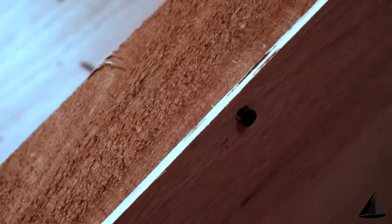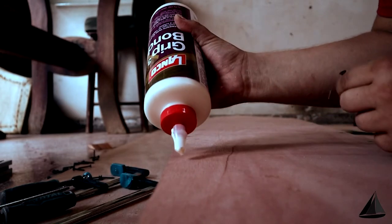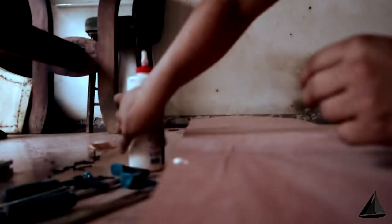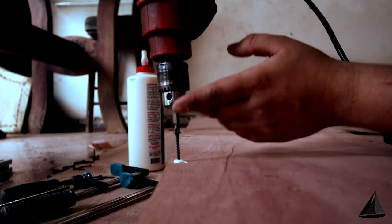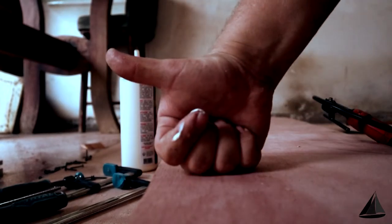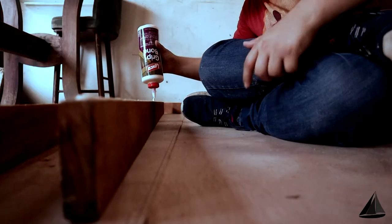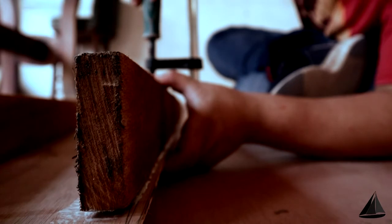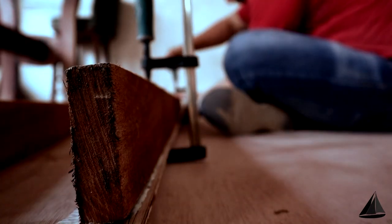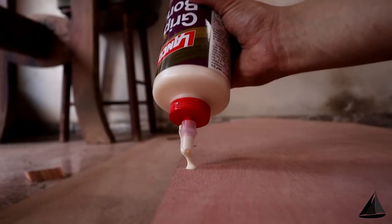To make it as watertight as possible, I pulled back the screws a little bit and then, with a tiny drop of glue, screwed them again so that the glue would act as a gasket. For the rest of the screws, I put a little blob of glue hoping it has the same effect to keep the bottom of the hull watertight. I proceeded to cut the other chines and then glued them up, using a few wood clamps to hold things in place. I used the same screwing method with the glue — putting a little blob and then screwing right through it.